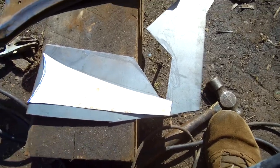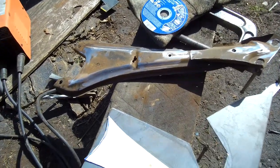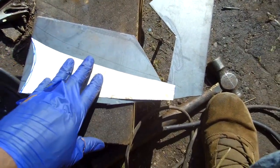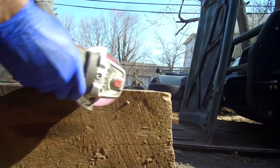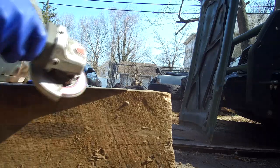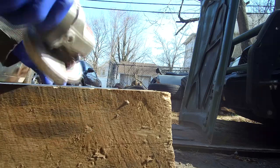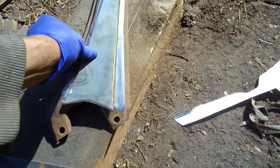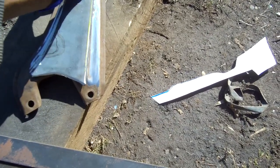This is scrap after scrap after scrap metal because I already cut out some pieces for the other side, but I'm going to start on this side first, and at the end of the video I'm going to show you a blunder I did. We're going to cut this thing out and get it trimmed up so we can weld it on. I got everything cut up, and now I'm just smoothing out the edges because these things were sharp with little burrs. I even drilled some holes. I did all of this behind the scenes — too much camera work in the dark areas. We put the piece on top with a beveled edge so when I start to weld, it'll penetrate nice and smooth into the creases. I needed to clamp this, so I found a C-clamp and that was a good deal.